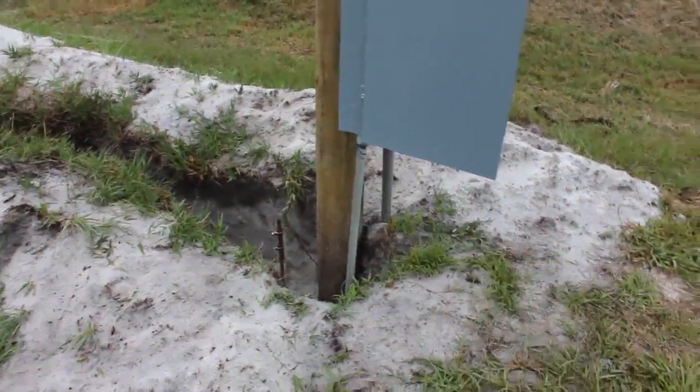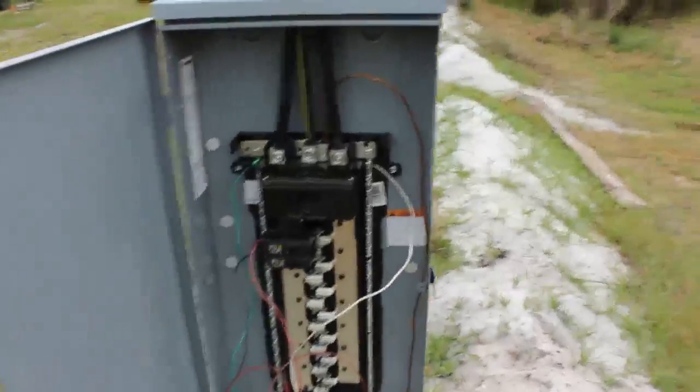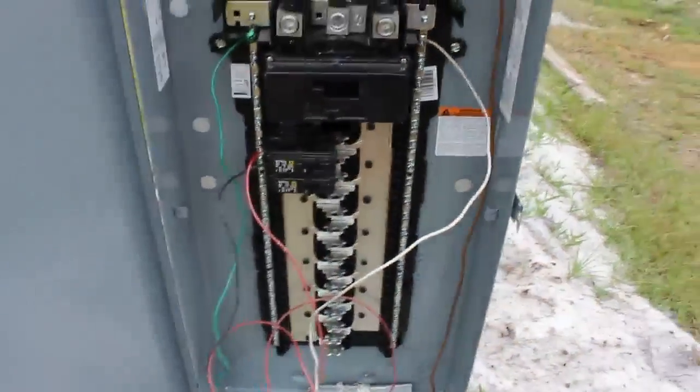They have drawings that show all the measurements. I got a 20-foot long pole and it was required to put five feet in the ground. This is going to be a 200-amp service. I bought an outdoor panel — you gotta make sure you get an outdoor panel. This is a Square D outdoor panel, 200 amps, and it has a bunch of slots. Let me show you the cover too — it has a bunch of slots and paper on the other side so you can write what each breaker is.